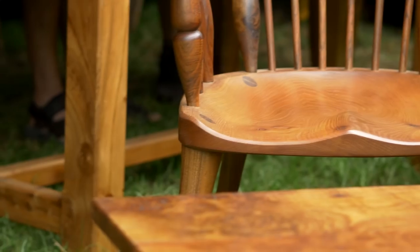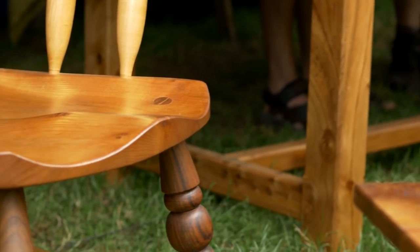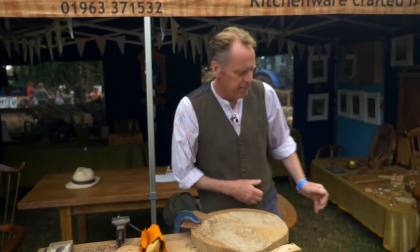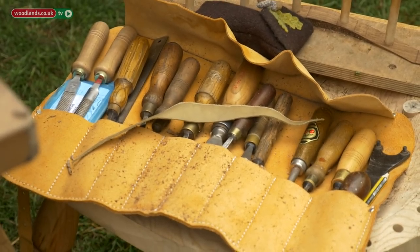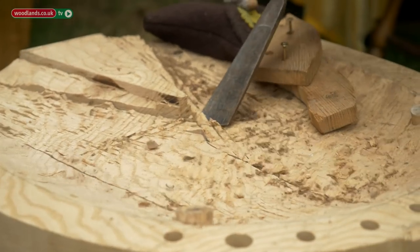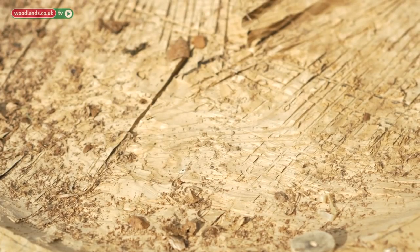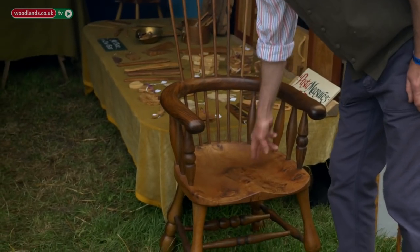The seat is the whole body of the chair — it's like the heart. If you don't have a good seat you'll waste many hours of hard work. Start by cutting with a circular saw, lots of cuts, and then you get a chisel and bash it all out. You basically chisel away all the rough saw marks. The low point in the seat is for the hip bones.